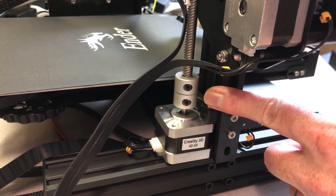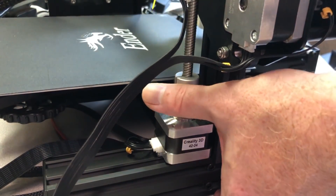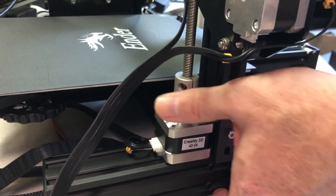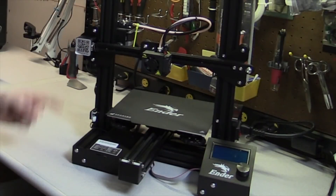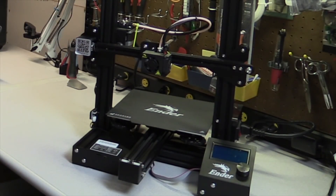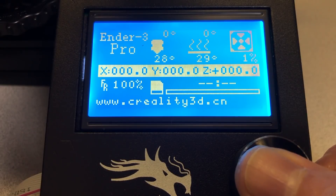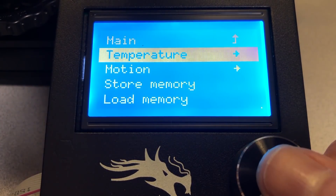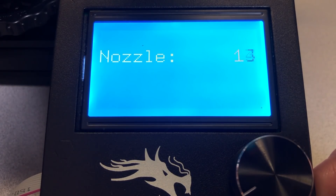You see this flexible coupler connecting the lead screw to the z-axis stepper motor? We're going to turn that by hand in a clockwise direction until we've got enough space under the nozzle to work. I recommend moving the z-axis at least halfway up its range of travel so we'll have room to work on the bed too. Once we have that raised up, we're going to turn the printer on again. Then, to heat only the nozzle without heating up the bed, press the control knob once to get into the printer's menu system. Select Control, then select Temperature, then select Nozzle. Turn the knob to set the nozzle to the working temperature of whatever filament you have loaded — I'm going to set mine to 200 degrees. Then press the knob again to begin heating.